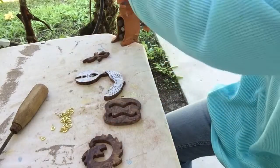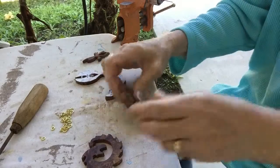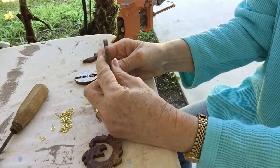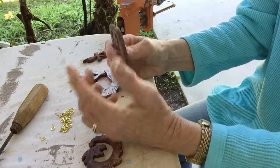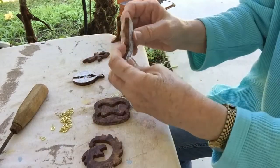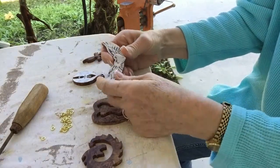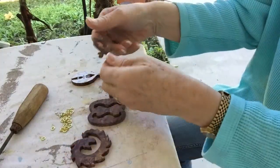I don't want to go too deep — I can always drill it out a little bit later. The reason I do that is to get the hole centered properly, because if I'm still going to end up sanding the outside somewhat, I don't want to end up with tolerances that are too fine. I'd rather put the holes in now and then work around that. I've actually already done that for each of these pieces — this one still has the pattern on it, and when I carve the detail into it some more, I'll be peeling off that paper.